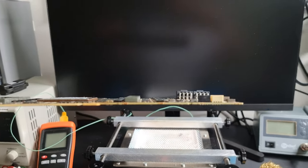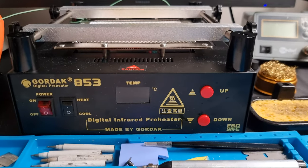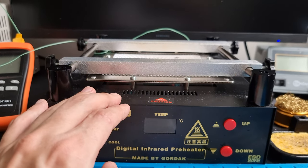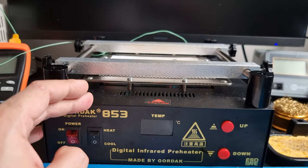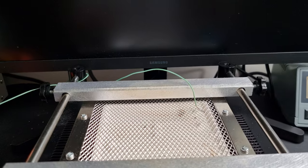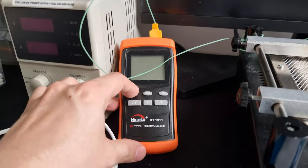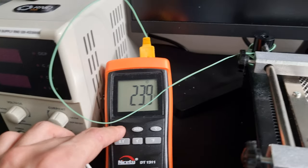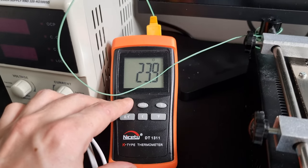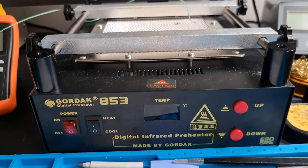I think that rumor has a lot more to do with the people using it than the equipment itself. Like I said, I keep this at 280°C. Also make sure you get yourself a K-type thermocouple — to be able to monitor the actual temperature on the board rather than what the preheater is telling you. This one is by Nicety, from AliExpress, and it's pretty accurate. I'm pretty happy with this one.